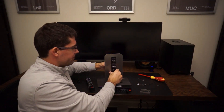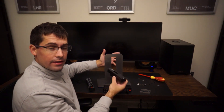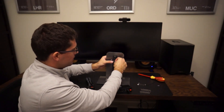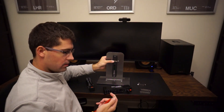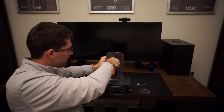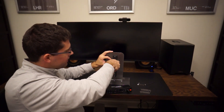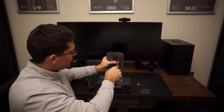So basically you take it and put it in from the front. You want to hold it in because otherwise it might fall out and could break. So you put it in, hold it in with a hand, then come around to the back of the panel. Take your little bracket, then take your screw and go ahead and screw it in — just like so — and that'll hold it in there really nicely. Then get it all straightened up. These standoffs on the outside are how you adjust the pressure associated to it.